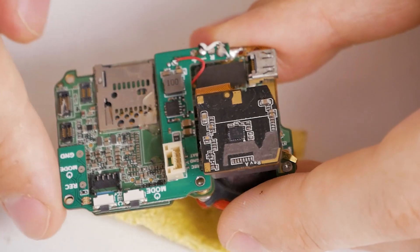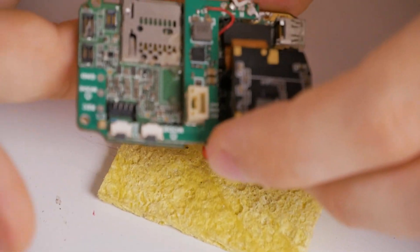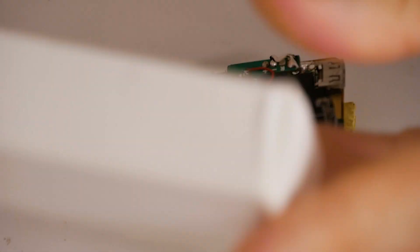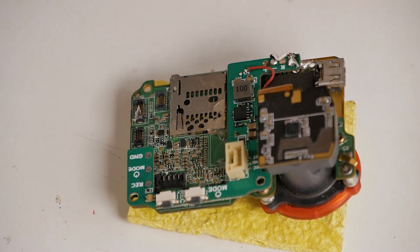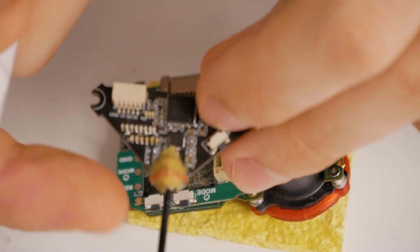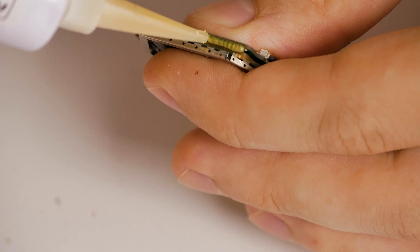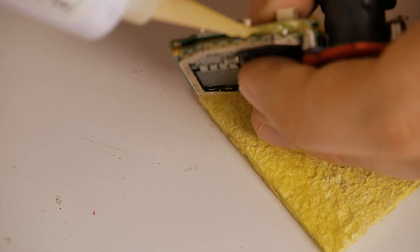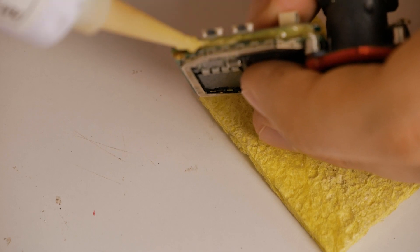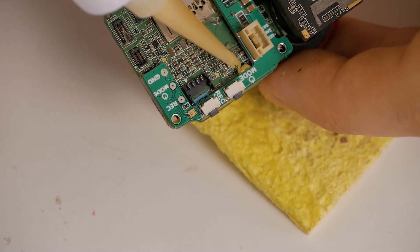What is left to do is secure it even further. This piece is secured but this piece is not, so what you need to do is glue it. You can use hot glue, but it gets a little bit warm and you don't want it to slide around. What I found is antenna glue — I will put a link in the description with a discount. It's like five bucks and it's the kind of glue they use on VTX. It's really good because it's heat resistant and also comes off if you decide you don't want it anymore. Just make sure it doesn't move around. Don't glue your buttons, and put some on the bottom part just to be extra careful.